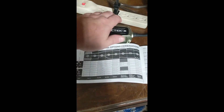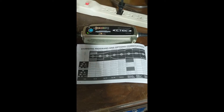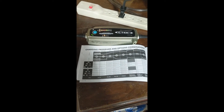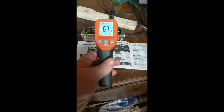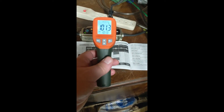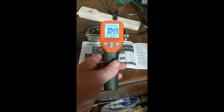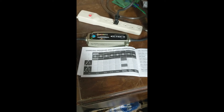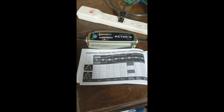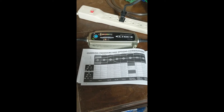Just seeing how the current draw is — everybody's favorite from the last video. It is warm to the touch but it's not hot. Here's ambient. And you can see it is drawing current — it's about 104 to 105 degrees. That's an indication of how much current is drawing. It's an indirect measurement, but you can tell that it is drawing more current.